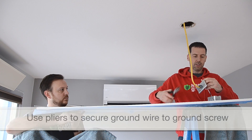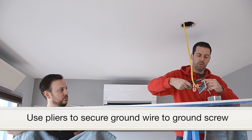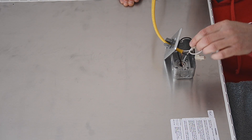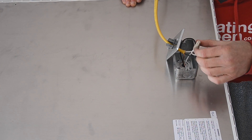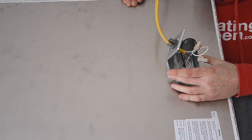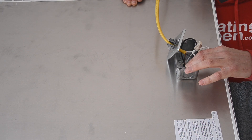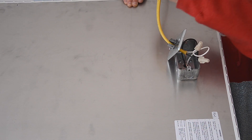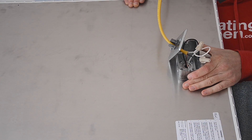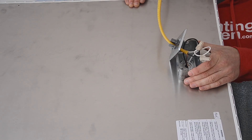We're going to take our needle-nose pliers here and bend the ground wire around so it attaches to the ground screw. Once the ground screw is connected, we can see there's enough wire that easily fits in here with enough space, and the box insulates the electrical connections. The Romex is connected to the box, which is attached to the panel itself — unlike a lot of electrical situations where you'd have a box in the ceiling for a light.